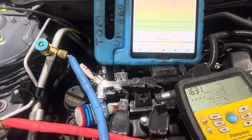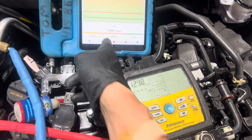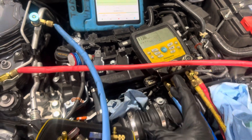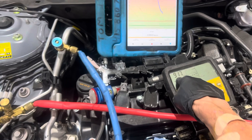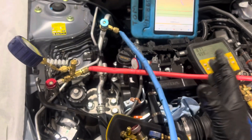But that is only at this point. If you look over here, we're 1300 or 4000 right there. So the loss of vacuum — the difference with the resistance going through the hoses to this point right here, to this point where this sensor is — is great. You have like a 2000-plus micron vacuum difference, because of just the hose restriction itself.